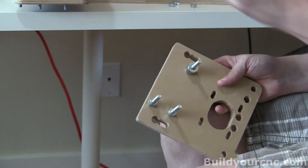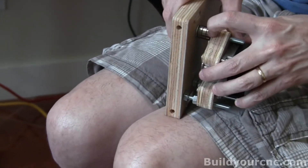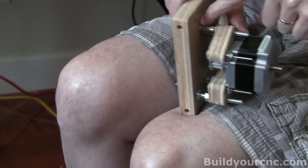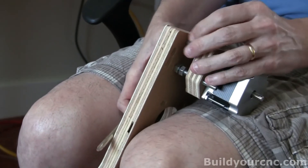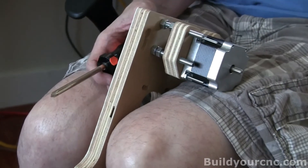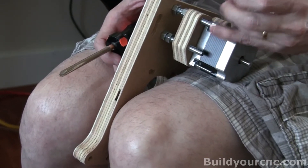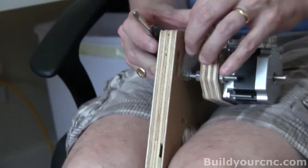Go ahead and put on the mount. You want to make sure it is up against this portion. Put that nut on first and tighten it down. These nuts have to be at the same distance as the three bearings plus washers, so we're going to add the final nuts. Then we're going to take some calipers and measure it. You don't really need calipers — I'm going to use them just because I want to get this perfectly parallel.